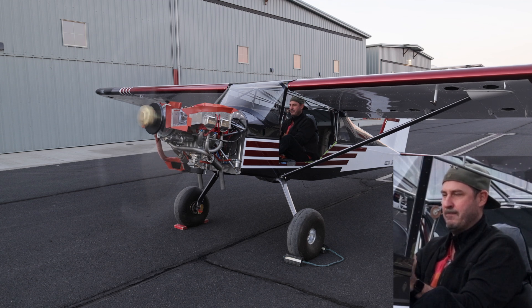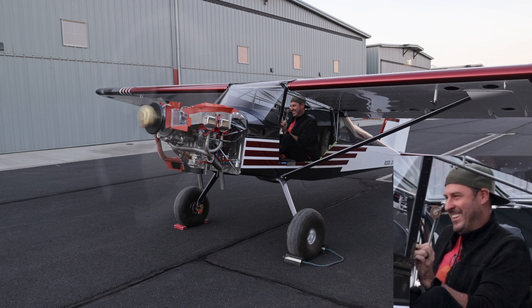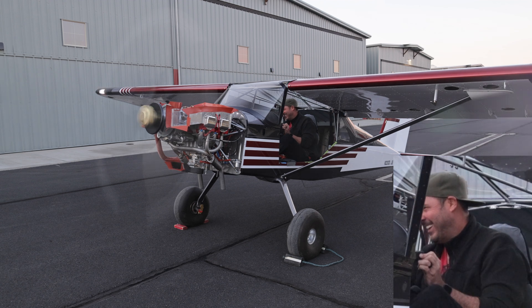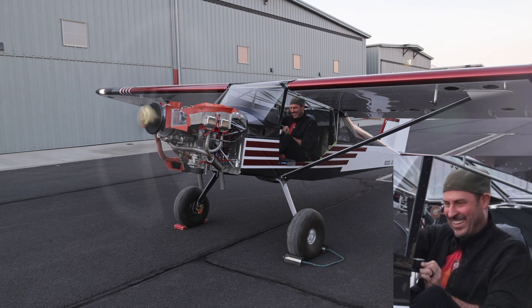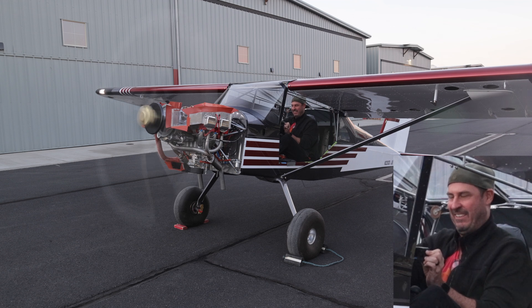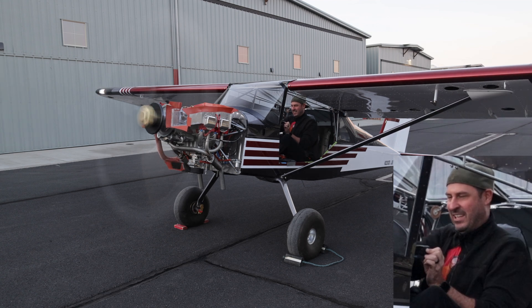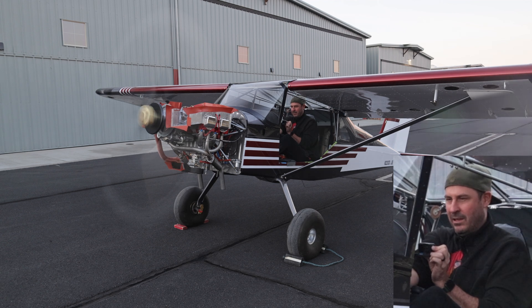Idle is a little too low — that should be pretty easy to adjust. I couldn't do a full throttle test since I didn't have an RPM indication. I've been anxious about the RPM since I wired the whole plane from scratch — this was the most complicated connection of the whole build, requiring a pull-down resistor at the Garmin Engine Analyzer, the GEA24. But looking at my interconnect schematics again, I think I have the fix. I emailed Klaus at 3 a.m. because I couldn't sleep, and he validated my concern — I definitely have the fix.